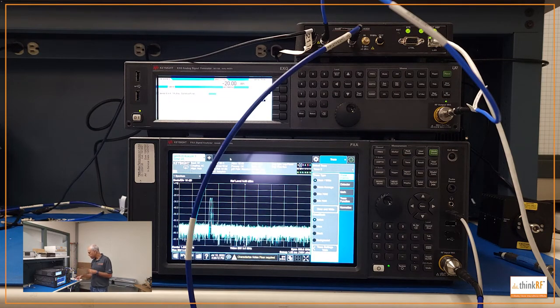The IF output, as mentioned, feeds into the spectrum analyzer. It's calibrated, so the RF input is equal to the IF output — it maintains the same level of minus 20 dBm. Taking into account the insertion losses of the cables, you get a slight degradation in signal level.